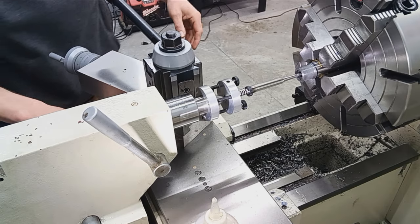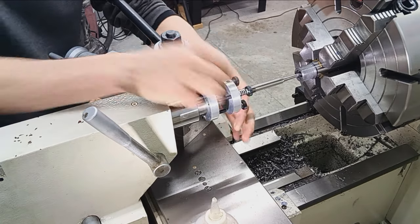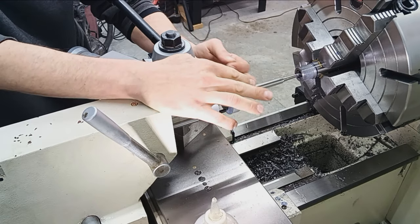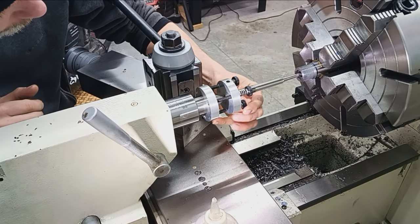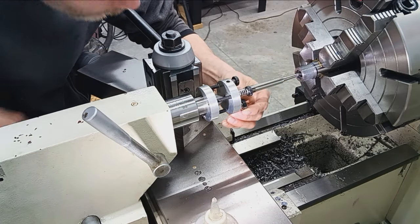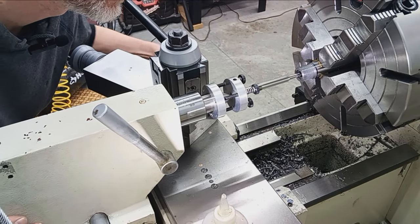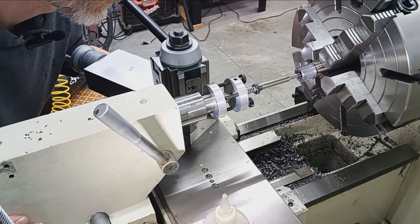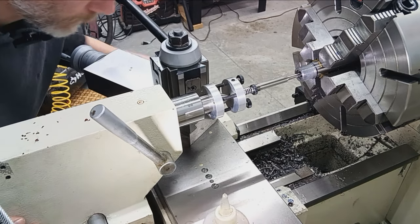Cool, here we are, ready to begin reaming. The GTR reamer holder has three spring-loaded set screws. And the idea here is you use these three to get this aligned very, very close to the bore. And so visually it looks pretty centered, so we're gonna go in until that bushing enters the actual bore. And it's looking like it's entering straight.